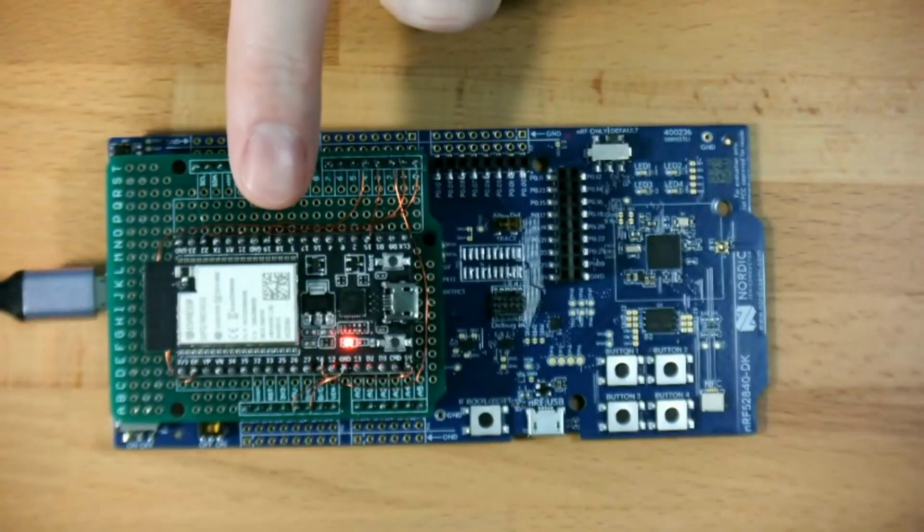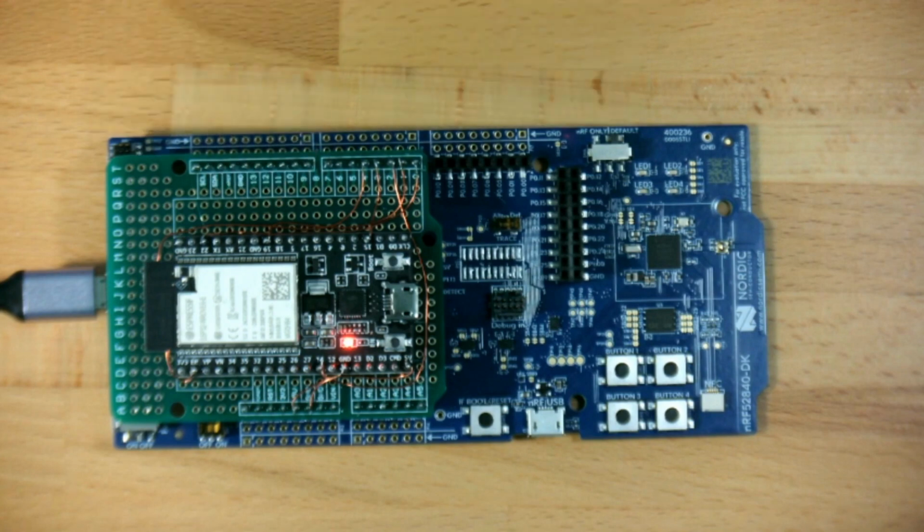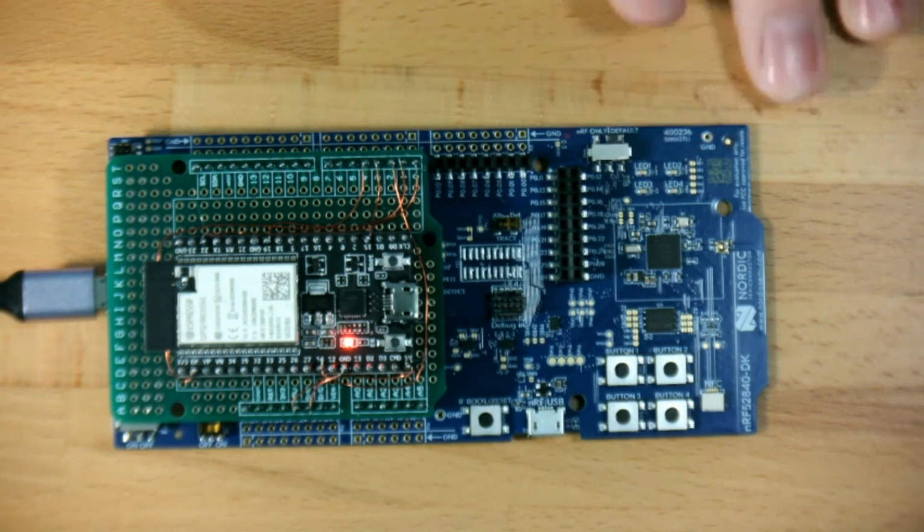That's great. And what is the hardware we'll actually be working on here? Yeah, so we're actually going to use the NRF52840DK, which is right here. This one has an ESP32 as an external Wi-Fi modem on it, but really whatever networking you're going to use is going to work. I picked this device because it doesn't have any special crypto hardware on there. And we're going to see a little demonstration of that once we get everything up and running on it.